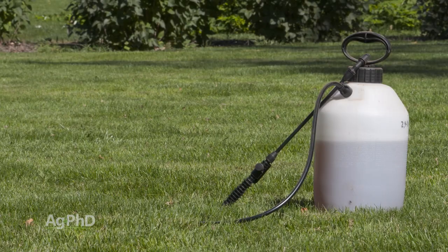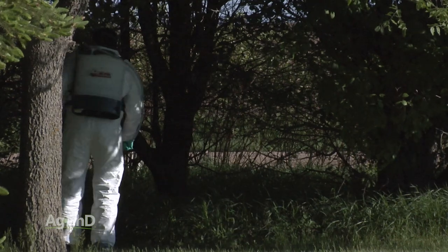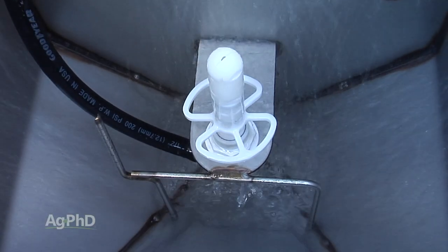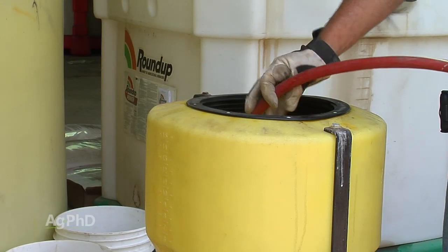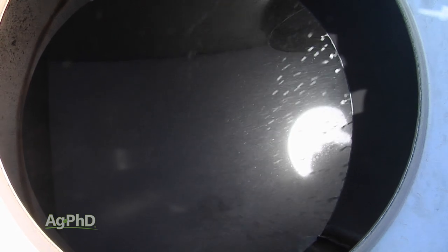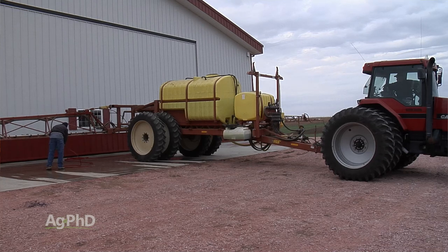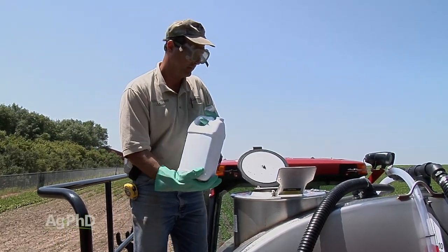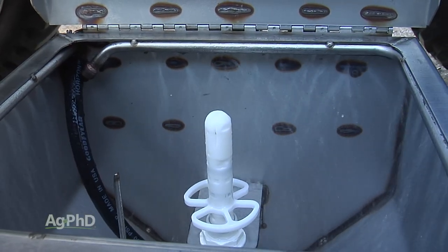Here's the thing: the dose always makes the poison. We talk about this all the time. You might figure, okay, if I triple rinse whatever I'm using — whether that's a backpack sprayer or a great big farm sprayer used on thousands of acres — well, just water ought to be pretty good. It is pretty good, but it's not perfect. Think about the material these tanks are made out of. Whether it's a backpack sprayer or most farm sprayers, they're made out of plastic. There are pores in that material, so there actually can be residue down into that tank, which is part of the reason why we really encourage people to use tank cleaners. There are different ones that work for different chemistries, but you want to do something more than just flush it with water three times.